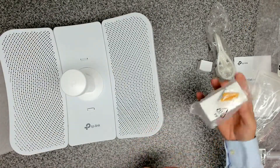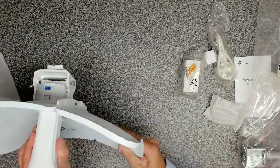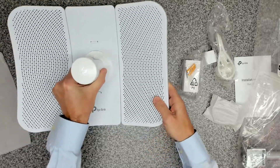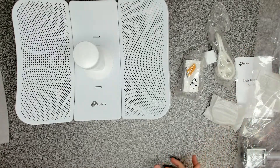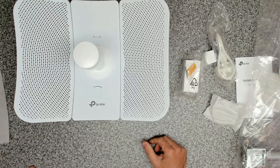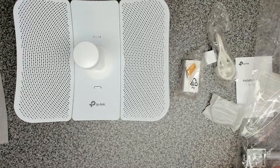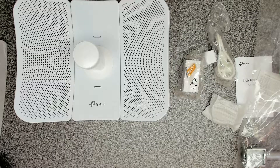They come with a POE adapter which is brilliant, so you can power the unit without a POE switch — though we're going to be using a POE switch because we've got additional devices to power like another access point. These will do a line-of-sight connection up to 15 kilometers, but our buildings are only 92 meters apart, so we're going to lower the power levels to make sure we're not pushing out too much power unnecessarily. We're not sure what the tuning mechanism is yet but we'll look at that when we start setting things up. If you found that video useful, give us a thumbs up, don't forget to subscribe, and thanks for watching!